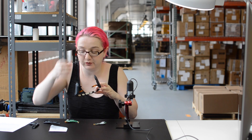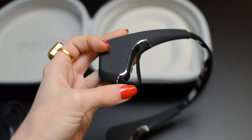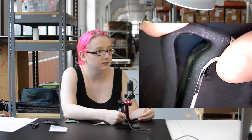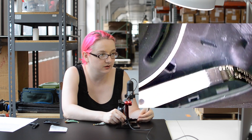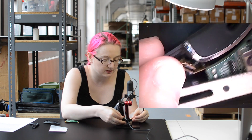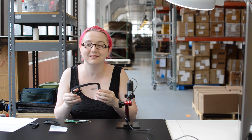There are three reference sensors in the front and two more sensors on the sides for temple measurements. But they also need measurements from behind your ear, and those parts are actually conductive rubber — not conductive enough to light up an LED, but conductive enough to get that signal from behind your ear into the circuit board. Under the microscope, we can see the flexible conductive rubber bonded to a metal piece that is part of the electrode, which extends to the enclosure. On each circuit board there's a little clip that, when assembled, presses against the metal piece, which presses against the conductive rubber — a really elegant solution that also feels nice against the skin.